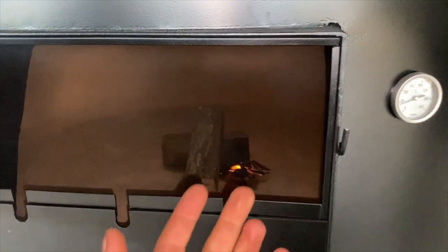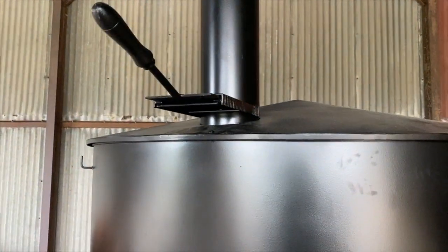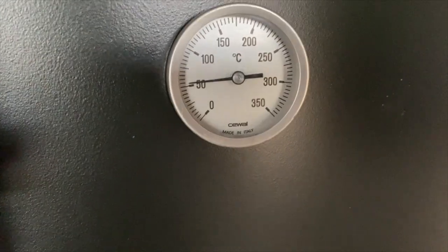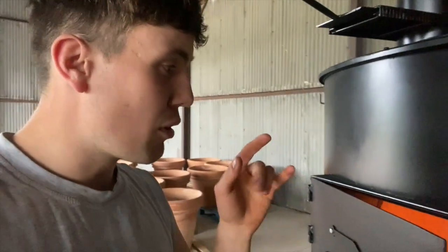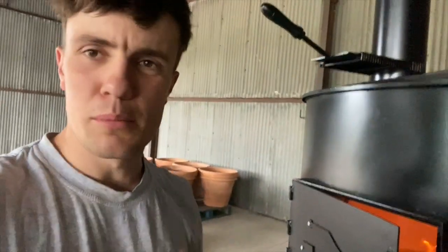We're just getting going at the moment. It's very smoky because these aren't the right logs — we need some more fully dried out logs and the smoke should reduce. That's just starting to get going, smoke coming up out the flue. There's an adjustment that controls airflow coming up the flue, which in turn controls temperature via the slider. We're starting to head up in temperature, taking a wee bit of fiddling. You can see there's a bit of moisture on the inside walls — that comes from moisture still in the unit burning off, and also these logs were just cut last year so they may not be properly dried out.